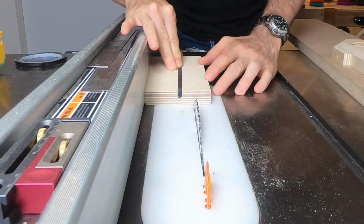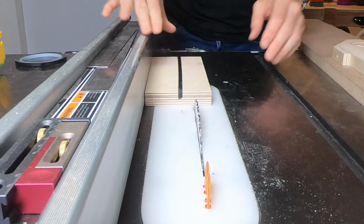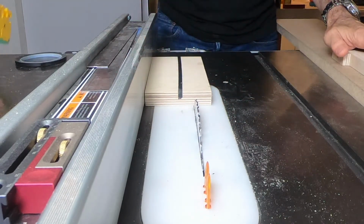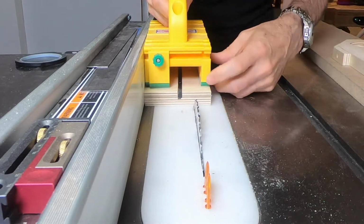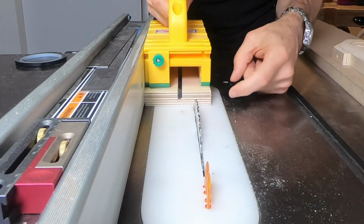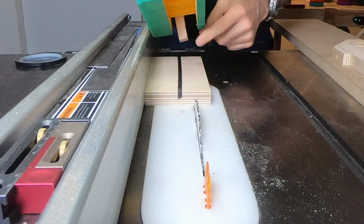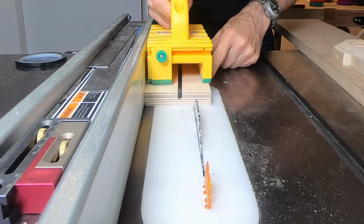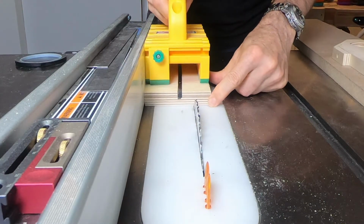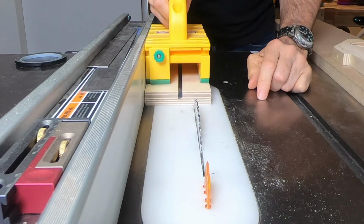Now, if you're not comfortable with that, and a lot of people aren't, that is the time you get a pusher or the block. Now, the block is pretty easy to set up for this. Here I have set up my block so that I have a tunnel here, and that's fine. And then I have my tailpiece right on the push line. See? So this is a very safe, smart way to make this cut.